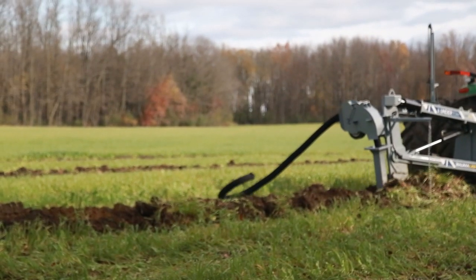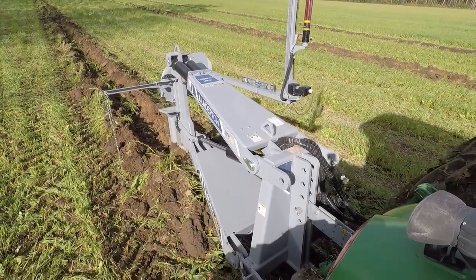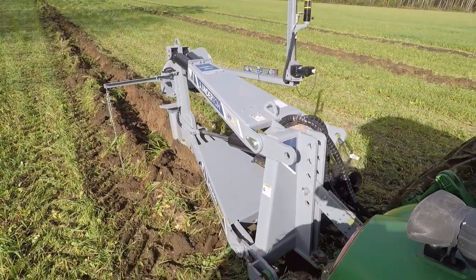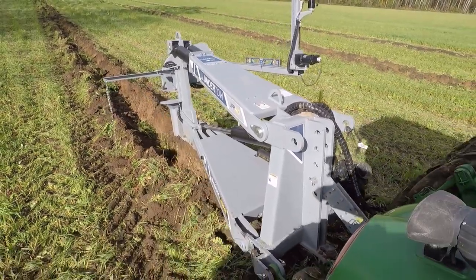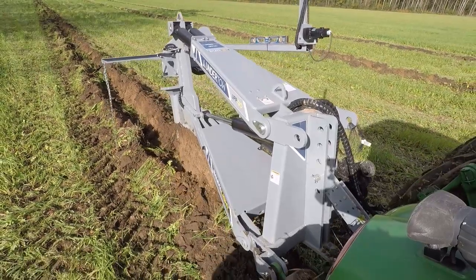Be sure to cap the tile end before it goes through the plough. Once the tile has finished and has run completely through the plough, switch the setting back to manual. Adjust the pitch upwards and plough forward up and out of the ground.